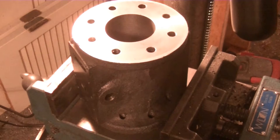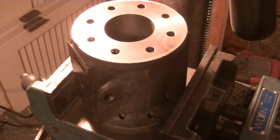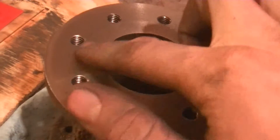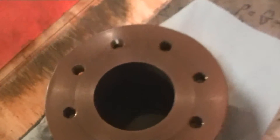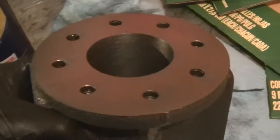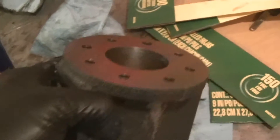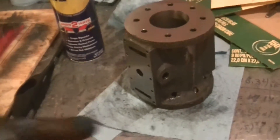I'm going to lap the top and the bottom cylinder heads the same way I lapped this surface. Here's a before shot — you can see the machining marks, especially between these two regions. Just finished lapping it — you can see the surface finish is way better, one nice consistent texture. It's nice and shiny. I went up to 400 grit again.